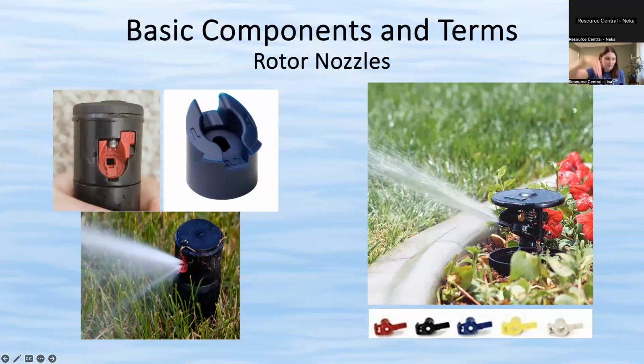So as you're pushing it down, that's kind of why it fans out. It's literally disrupting the path of the water and making it fan. Then as you loosen it and lengthen it, it's going to go back up, but you can accidentally unscrew it to the point where the nozzle is going to shoot right off, because the screw is what holds it in place. So do be careful as you're adjusting the radius to not back it out too much.